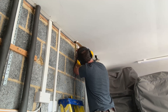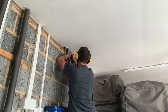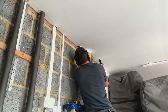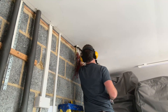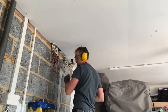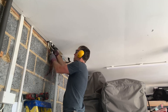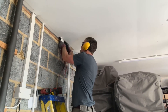You can see me cutting a hole in the plasterboard ceiling with a multi-tool. I can't get access to the ceiling space in this garage, but I need to put a little bit of slack down on some of the cables and link them up. By making a hole above where the main junction box is going to go, I can get my arm up there and free up a little bit of the cabling. Although I've cut quite a big hole, it will be completely covered by the junction box when it goes in, so none of that will end up being seen.